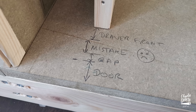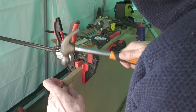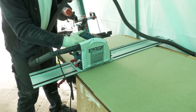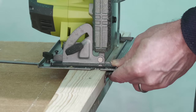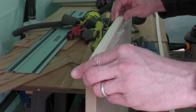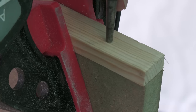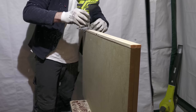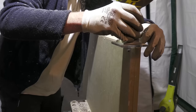There was a bit of trial and error here — I somehow made the first frame too short, meaning I had to add some additional fillets to the back of the frame to bring it forward to the desired point. I cut the frame itself using my plunge saw and as the front edge of the MDF would be on show I decided to add a pine edge, which I cut with my circular saw from some off cuts, then pinned and glued into place and trimmed flush with the MDF using a trim cutter on my router. Resetting the pins with a punch so that they can be filled later on — placing two frames together gave me a really secure base to run the router along.